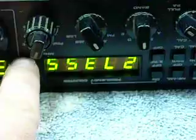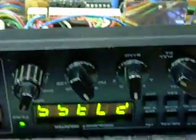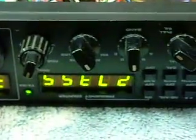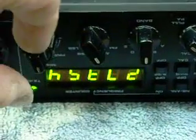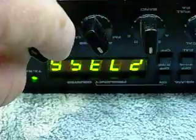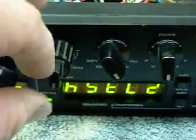What I'm concerned with is this last sixth digit. The frequency counter module in here does have the capability of displaying it, but they only put five digits in there. So you've got a lot of movement in your fine clarifier in order to get that last digit to do anything. A sixth digit is really helpful on the sideband.